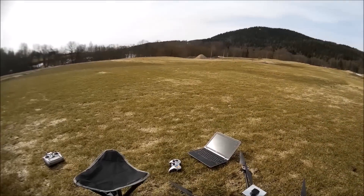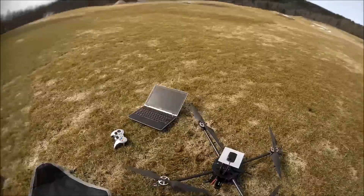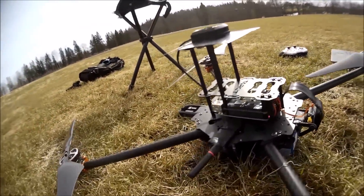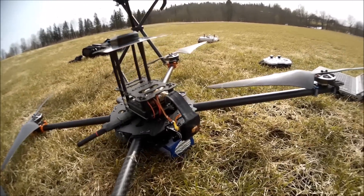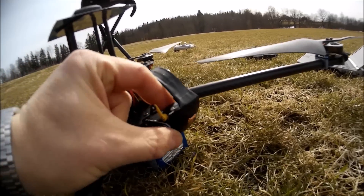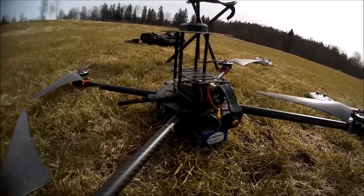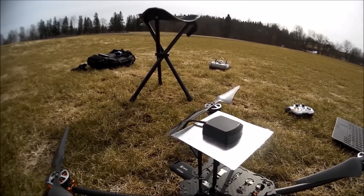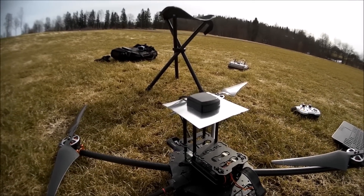I'm going to give you a little demo of my current setup. Here is my quadcopter — it is running a Raspberry Pi 2 and an AVR controller board. I'm using the Raspberry Pi camera at the front on a little tilt mechanism. I have to shield it because there's a lot of noise from it interfering with the GPS. I also put the GPS on a stand with a big ground plate made of aluminium, which improved the signal quite a lot.